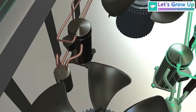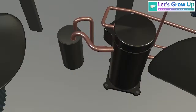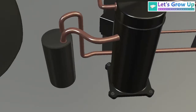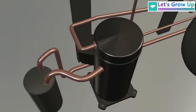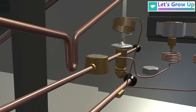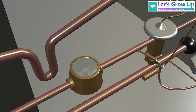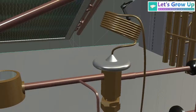Next, in the middle compartment, there are two sets of components. We will focus on just one side. This large component is the compressor — it is truly the heart of this AC system. And here you will see a small glass where you can visually check the condition of the refrigerant gas during its operation. This is the expansion valve, a very crucial and important component.